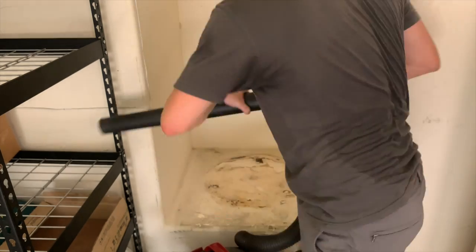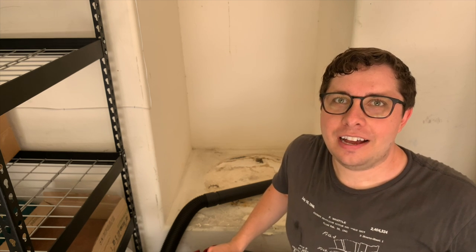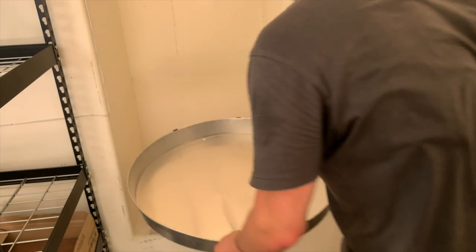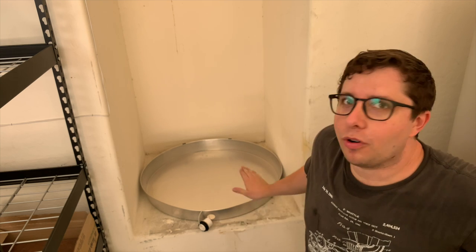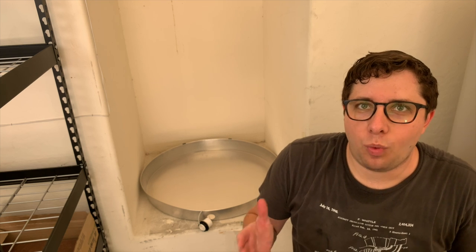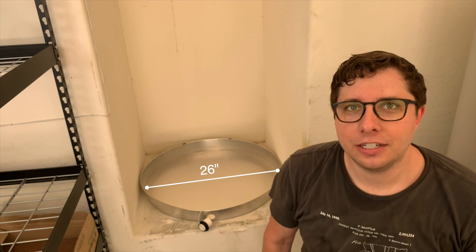It's kind of nasty down here so I'm just going to use a shop vac to clean it up. This is just another reason why you've got to use a drain pan. I did get lucky that there wasn't a big leak and I didn't have to spend money replacing the sheetrock, but it's grimy, so I'm definitely going to put the pan in before installing the new unit. A couple of things to keep in mind with the drain pan: definitely get one; go for a steel or aluminum one over plastic because plastic can get brittle and crack. This one was about $20 to $30 versus $10 to $15 for plastic — worth it. And get a pan that's two or three inches wider than your water heater.